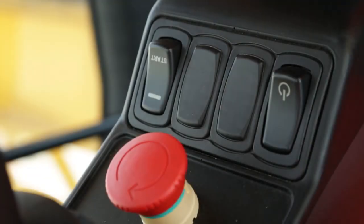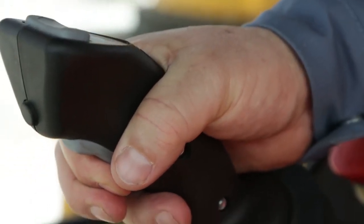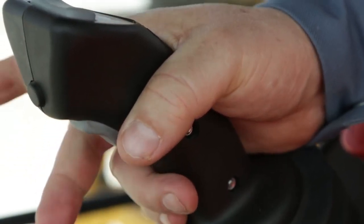This function allows you to pause in safety without completely stopping the crane. To exit standby mode, press the start button and then press the button for validating movements and leave it pressed down. You can then take your finger off this button.